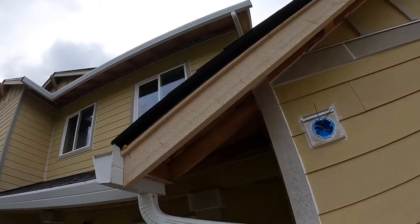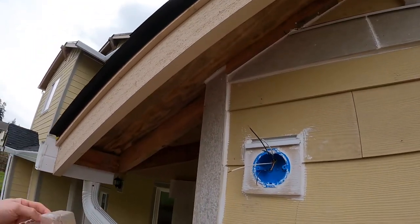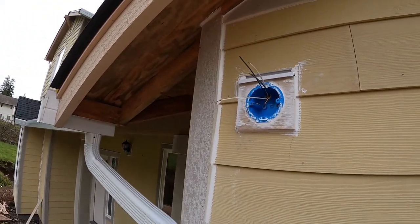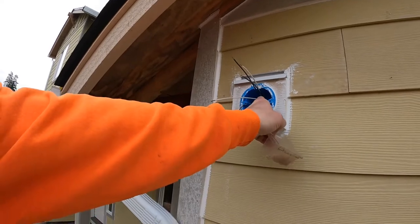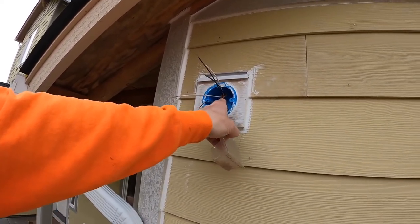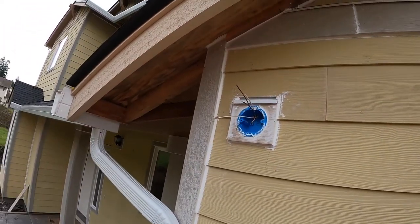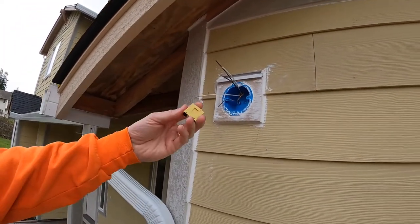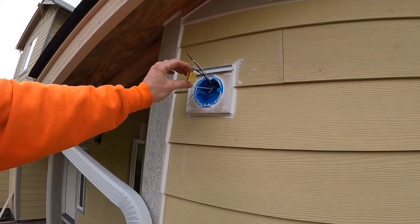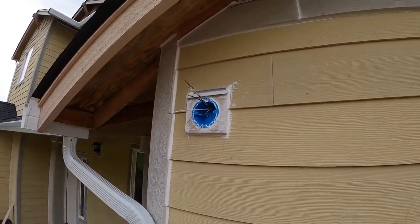And then, not just twisting though, you need to put a clamp on it like this. And I'll show that. And you're gonna crimp it on so that there's no way any connection can get broke at this ground. And then the security light that I have comes with a nice pigtail quick connect that those are gonna connect onto. I have one on the light, and you'll see that whole process.